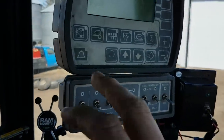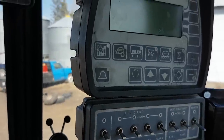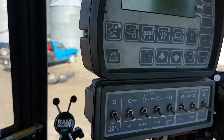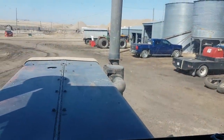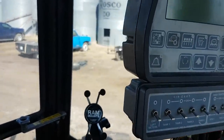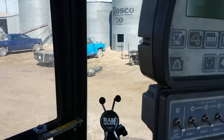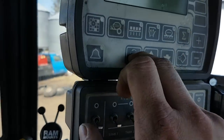I've got the monitors in. I had to do a little bit of work yesterday with the air seeder monitor — it was saying no remotes installed. Spent all morning phoning around different dealerships trying to find information about what could be causing that. They gave us a bunch of different things to try, and of course none of them worked. It ended up we were zip-tying the harness down on the cultivator, and Antoine noticed a pinched spot. Opened it up and lo and behold we had two broken wires.